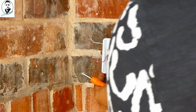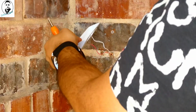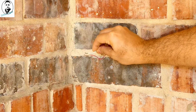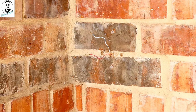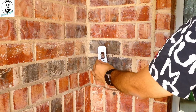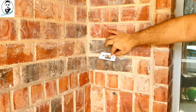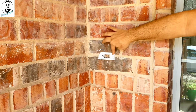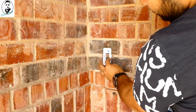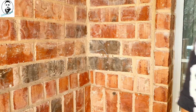So basically I can see that it might fit with my previous mechanical doorbell, and I was thinking that I don't have to drill it. However, the previous mechanical doorbell was installed horizontally and I cannot do this horizontally, but the vertical was for the Ring doorbell bracket, so it's a little bit bigger than the Ring. The Ring doorbell bracket was bigger, so this is smaller, and definitely I have to drill one end at least. See that? It's the horizontal, it fits perfectly, but this camera needs to be in vertical shape, so I have to drill it. I thought I don't need to drill it, but now I have to. However, what I'm planning is I'm going to use one point from the Ring doorbell's previous bracket, and another point I need to drill, so I'm going to start drilling it.